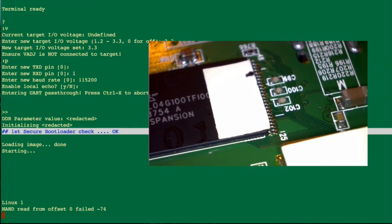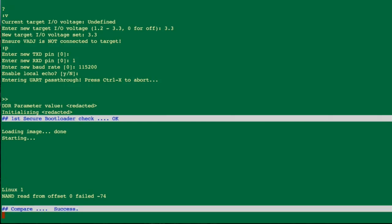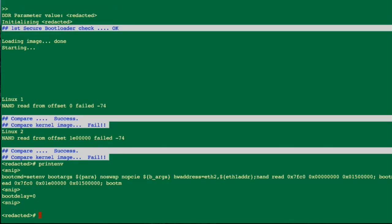As you can see using a serial console on these devices, you can track what's going on. I'm poking the flash device to get the second partition to fail as well. They designed this device to not respond to any serial input. But what happens is they misconfigured it so that if it fails twice in a row — the primary and the secondary partition — I get a u-boot prompt. Excellent. That gets me in.